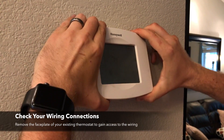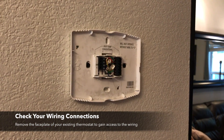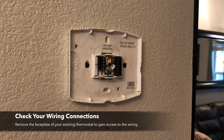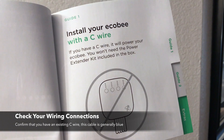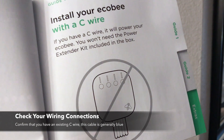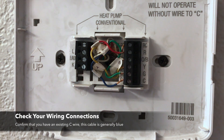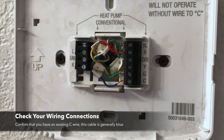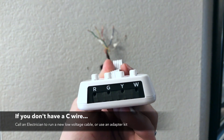Now I'd recommend that before you even go out and purchase a new smart thermostat, you remove your old one and inspect the wiring that goes into it. What you're looking for is to see if you have what's called a common wire. This is generally a blue wire and it's what provides the actual power to the thermostat. Without it, the thermostat's not going to work. If you don't have one of those wires, you're going to either need to hire an electrician or have a contingency plan with an adapter.